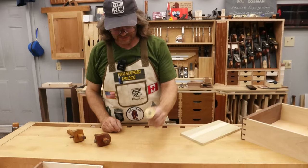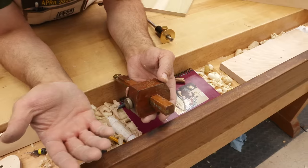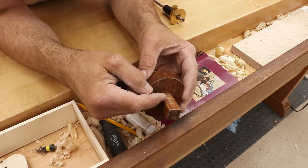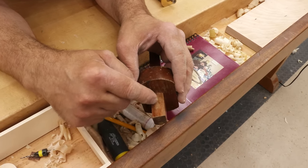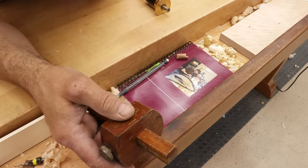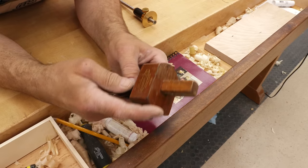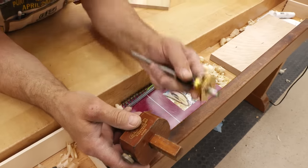There are a few different types of gauges. I didn't start off with a wheel gauge. I started off with what you might call a pin gauge. They also make a slitting gauge — it has a wedge in there and a knife. The pin gauge, which I think is the most common, gives you literally a round pin. Unless you know enough to modify it — you can tell by the file marks that I've gone in there and modified it — when you drag that across the grain, it just tears and scratches. It's terrible. The slitting gauge works a little bit better, but doesn't always work very well when you're going parallel to the grain. So the biggest reasons I prefer the wheel style gauge — actually there are a few of them.